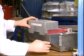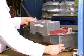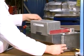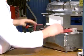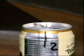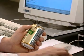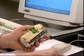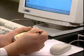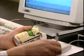Now, it is possible to section the can with the saw at the marked positions. This will allow for measuring the internal dimensions with a projector. With an appropriate tool, push the sectioned part of the seam into the can, exposing the cross-section to be measured. If it is necessary, clean the exposed cross-section with an eraser.